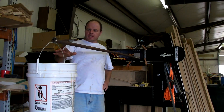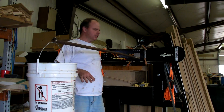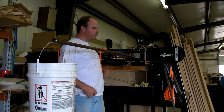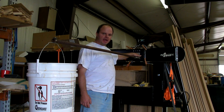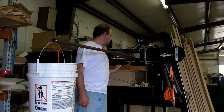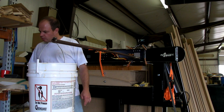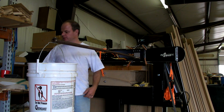So what I've done here is I've got a pretty simple setup. I've got my bucket hanging on the end here, and I'm going to slowly add water to it in order to increase the forces applied to this board. I've done a little bit of math, and the preload on these upper inserts from just the weight of the bucket and the weight of the lever arm comes to about 120 pounds of tension shared between those two inserts.